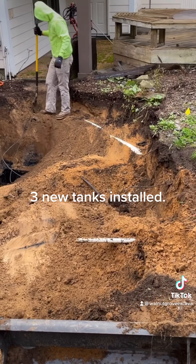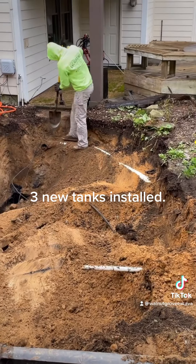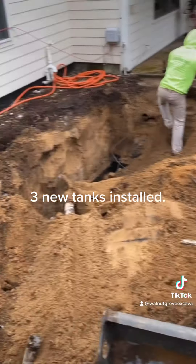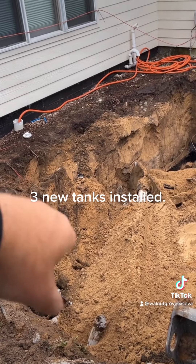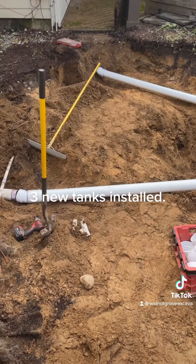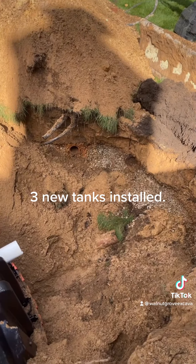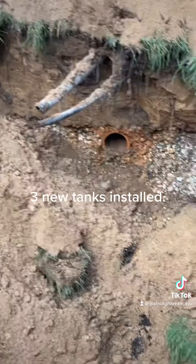We might almost have all three inlet sides figured out. We just hit a couple cables — we've got a sprinkler line, a sprinkler wire, and a conduit we didn't know about. Two-inch conduit, not sure what that goes to. All sorts of stuff buried in here. This is an odd-looking one, but we have one there, one there, and one going in there. It's an old drain field — we're having to dig in to put this new tank in and we covered up part of it.